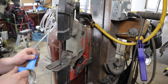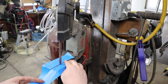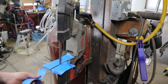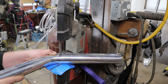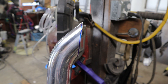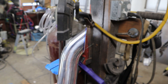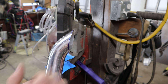We're using clean aluminum so I'm going to mask off my fence before I go to cut this so we don't scratch our aluminum, and we're just gonna cut this on the little port-a-band here. If you have a horizontal bandsaw that would probably do better, but I just got my little bandsaw. I did not cut right up to my line — I left about a 32nd of an inch, which will allow me to grind back to exactly where I want it. You may want to leave a little more than a 32nd; that's just my comfortable margin of error. If you have less experience, give yourself a little more.